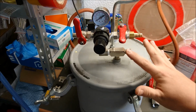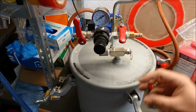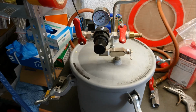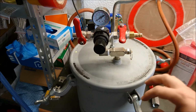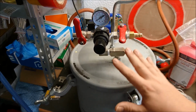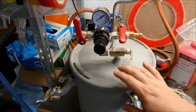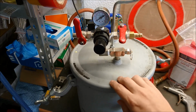And we keep it as long as the material is liquid, and when it starts to solidify and becomes hard, then it traps the bubbles inside. So these bubbles are non-existent. The molecules from the gases are trapped inside the molecules of the resin. That's the trick. So you don't shrink any bubbles, you capture them inside the molecules. And to hold them there, you definitely need to make sure to wait the complete time till demold.